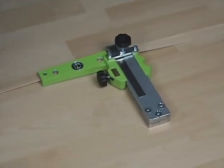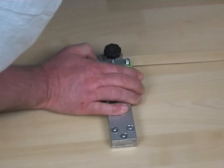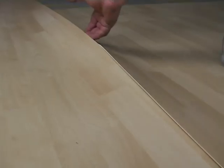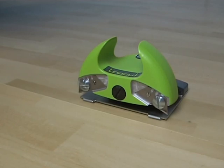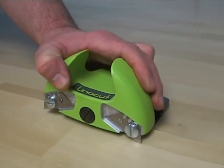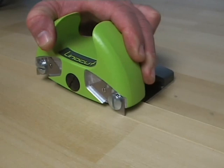At first, the production edge of the upper floor layer will be cut even with a strip cutter. The evenly cut floor layer will now be placed underneath the other layer. Using the linocut, the width of the gap is infinitely adjustable. Because it has two blades, it is possible to cut from wall to wall. The knife cuts the upper floor layer and uses the evenly cut edge of the lower floor layer as guidance.